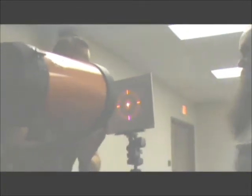Now we're following step by step the video. At this point, your focal plane axis is aligned to the primary mirror's optical axis. Now reinstall the secondary mirror assembly into the telescope. It's probably better to do it that one. Or this one, maybe. Double check if the scope is still aligned with the collimator and adjust if necessary.